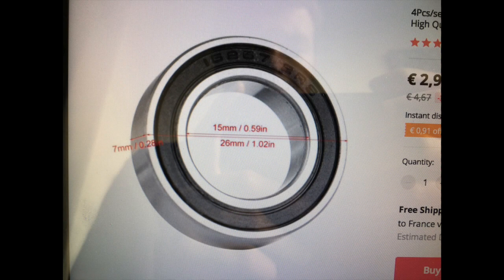And bearings. I needed bearings for the fins, for the top and bottom fin to turn, to rotate the fin and make it watertight. These are not the right dimensions for the bearings. The bearings are actually, in my case, 6 millimeter inner diameter, and I think it's probably 15 mil exterior diameter. Because I had 6 mil diameter aluminium tubes that would go inside the inner diameter of the bearing. So these are not the right dimensions, but they're the same thing I've bought. They're not completely watertight, but I put a load of grease around it, which made it watertight.